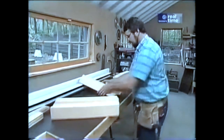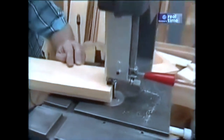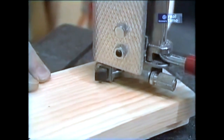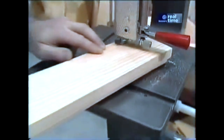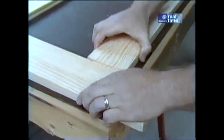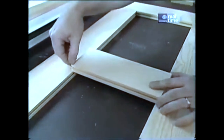The next thing I want to do is cut an arc in the bottom of each leg piece — one on the front and one on the side. I'll use this piece as a pattern to do my layout and cut them over on the bandsaw. I suppose I could have cut these with my saber saw and could have cut them one at a time, but I like to put them in pairs because it makes the operation go faster. Now you begin to see what the front and sides of our blanket chest are going to look like. There's one more piece I have to make — the center style — and I have to put a tongue in each end so that it'll fit in the groove we've made for the panels. I'll do that over on the table saw.